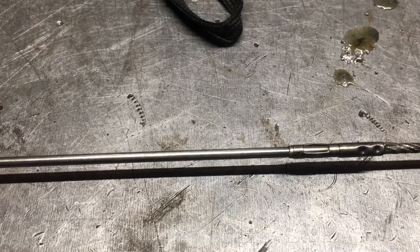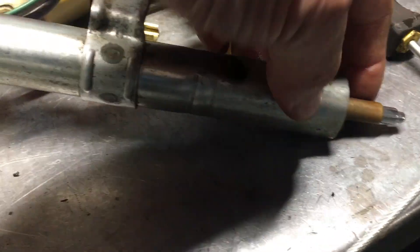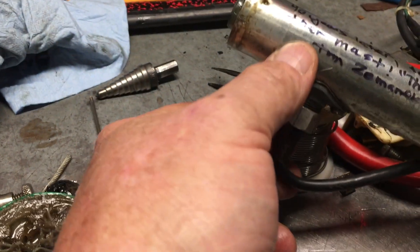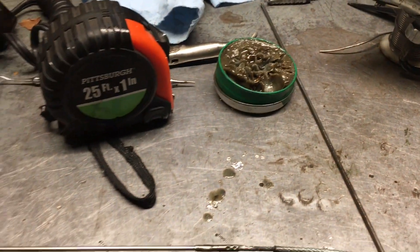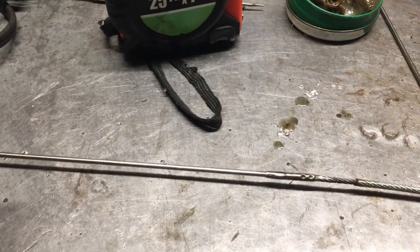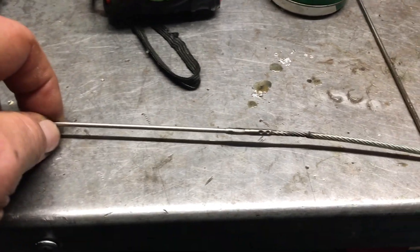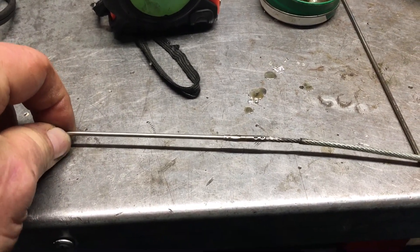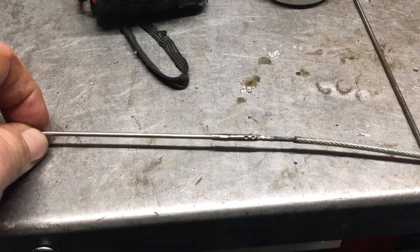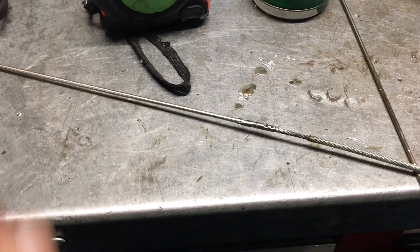If we don't have a conductor from stage one to stage two to stage three — and this brass casing would be stage four going to the nut for the mast itself — then we've got nothing, we don't have an antenna. So be mindful of that. I'm not saying adjust that brush; just be very delicate with it when doing your work. These complete units are available on eBay and some car sites, so if you don't want to go through all this hassle, you don't have to.